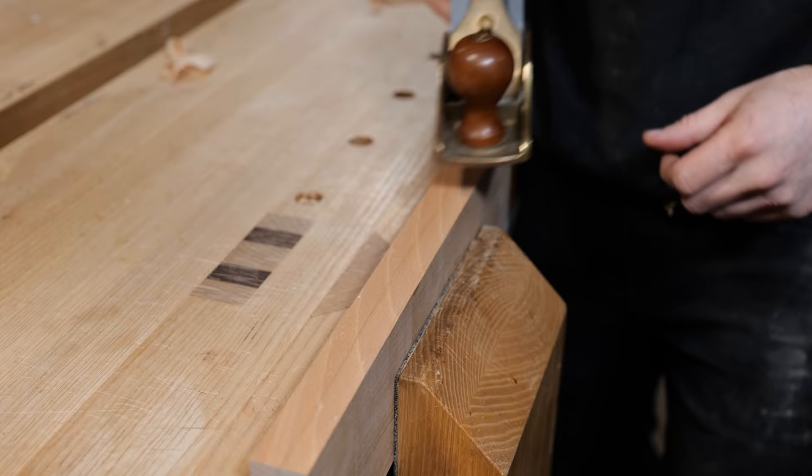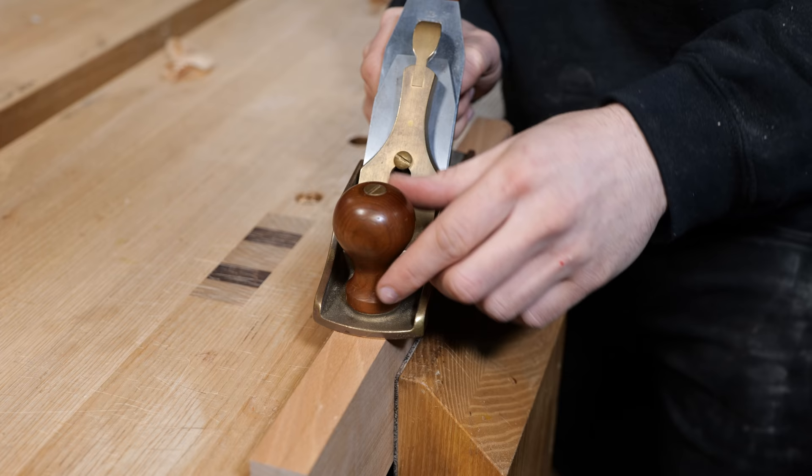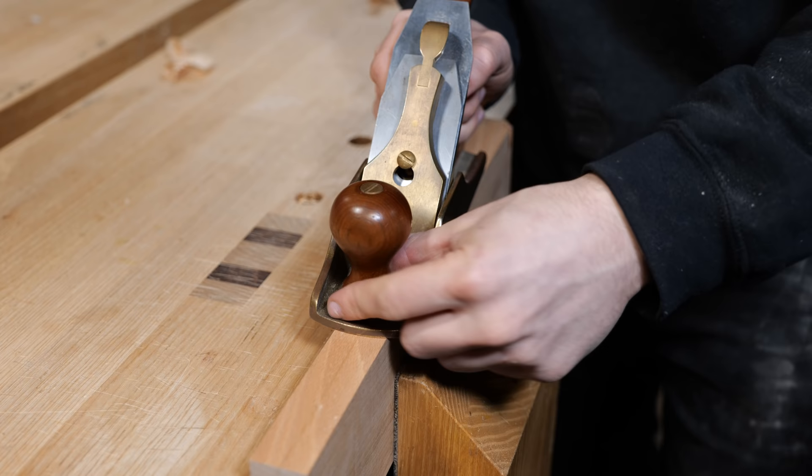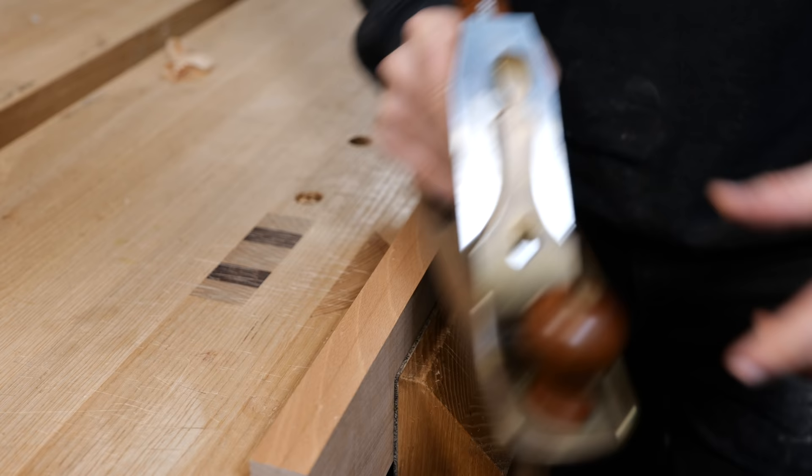If I'm doing really heavy work, I'll hold the front tote with a full grip. If I'm doing very fine work, I'll hook my finger over the front and use it as a fence. For general work, my advice is to grip it somewhere down low on the tote. Holding it high is top-heavy and more likely to rock, whereas gripping low keeps the center of gravity nice and low and helps keep everything stable while planing. In reality, you shouldn't need a lot of pressure on the front of the plane to make it cut — as long as it's sharp, it will stay in the cut itself.